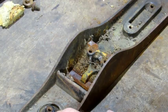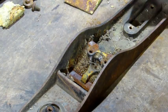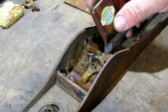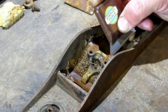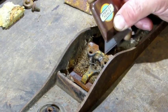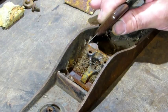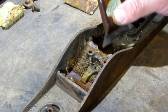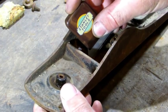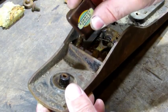I'm going to show how to do these other pieces — the cap iron, the iron, the lever cap, the frog — in separate videos. But while we've got the base out, you've got some flat machine surface right here that the frog mounts onto, and there's also some up front where the iron touches the base. Just get your scraper in there — I'm not pushing hard, just letting the scraper do the work to remove that rust. I scraped the rust off of the seat that the frog goes on, and I can also get it down in here with the iron. There's a machine surface at the very bottom edge — scrape that rust off.